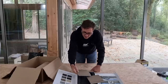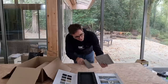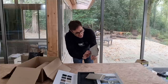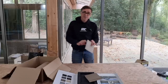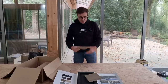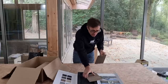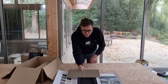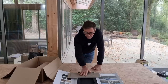The installer pack comes with actual full-size samples of the cladding. This is one of the colors — it's 11 millimeters thick, a super solid looking material, and it's got a really innovative tongue and groove system. There are no clips involved; as I said, you start at the bottom, you can install it horizontally or vertically, you start with a starter profile, the cladding clips in, get it nice and true and away you go. You fix basically through the tongue, the groove comes down over the top and covers the fixing, and there's a beautiful V-groove — very similar to a traditional timber tongue and groove. You can see this cedar texture too; it's a very realistic texture.